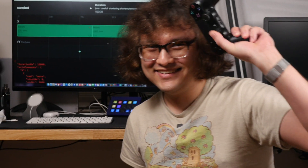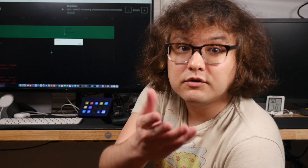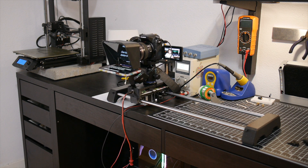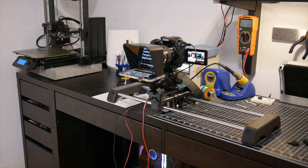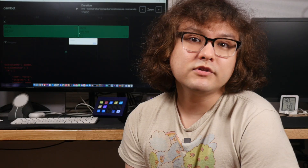Pretty cool, right? You just watched about 30 seconds of montage, but it's been well over a week since I last said anything in this video. Obviously it's working — let me give you a bit of a tour. Let's try out a pre-programmed movement first. I've added a play button to the web interface, and when I click that, the robot goes through a homing procedure, then the camera does whatever is programmed. One issue with this design is that the center of gravity is pretty high up off the rails, so it's easy for the camera to get into an oscillating motion, especially with a big camera, lens, and teleprompter on there. That'll definitely need to be addressed in a future redesign.